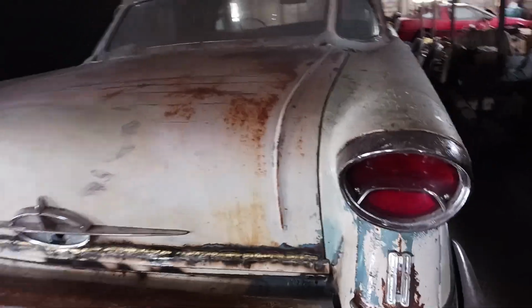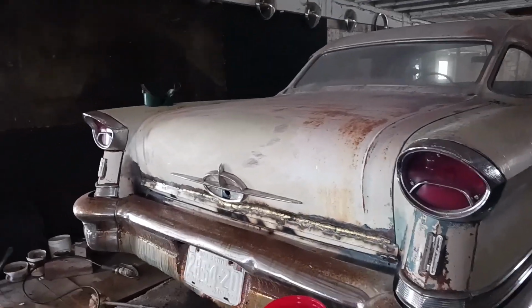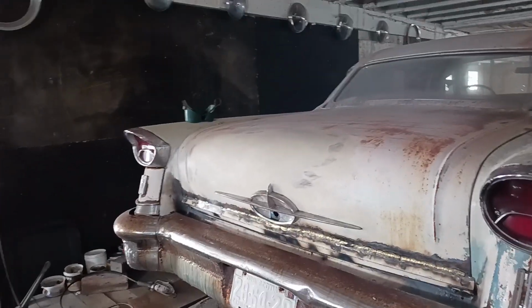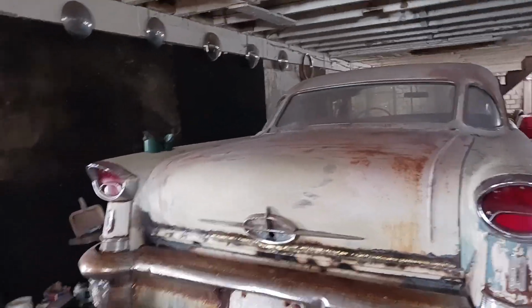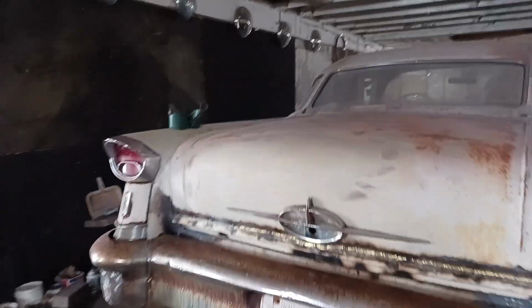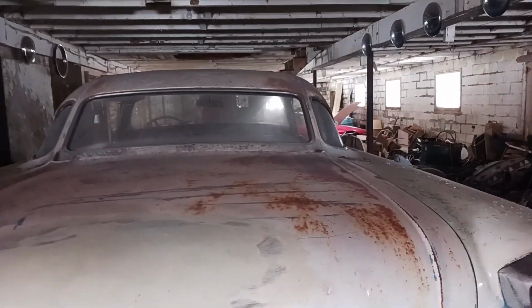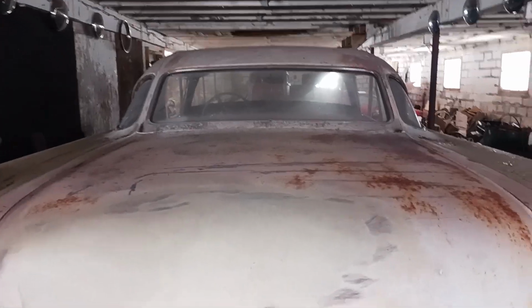the bronze to stay at the weld or at the joint. Otherwise it goes out on the sheet metal and then it bridges it. And then it's hard to get it to go back in until you start again. But as long as you just heat the V that you're welding and get the bronze in there and get out of there, then the heat doesn't go out on the sheet metal and suck the bronze away from your weld.